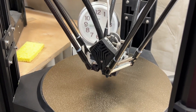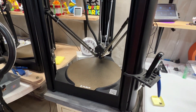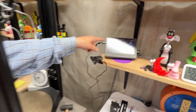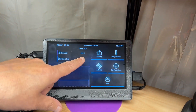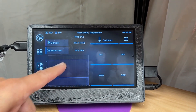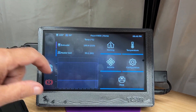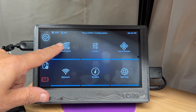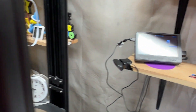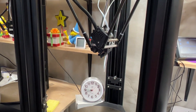I'm not going to show you this whole process but I'll come back when it's done. Once the bed level is complete, you can see it returns to the original menu and the heat has shut off. Go to temperature, PLA, let it heat back up — I'm more concerned about the bed, so leave the bed at 60. Then go back to configuration, bed level, and now do the bed mesh.